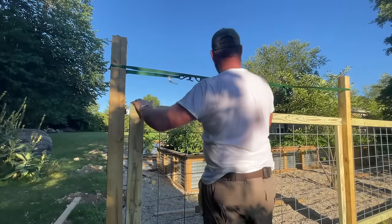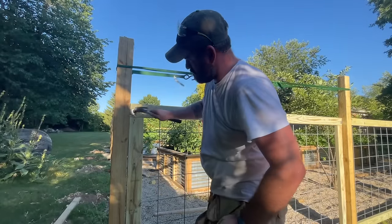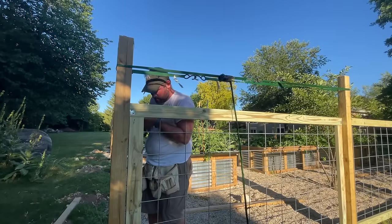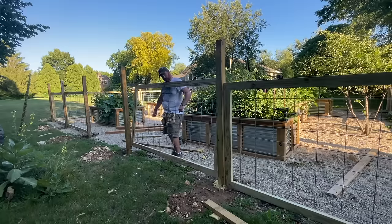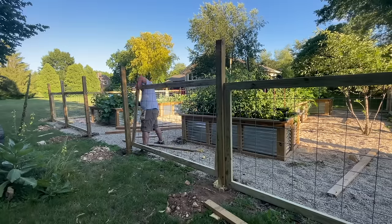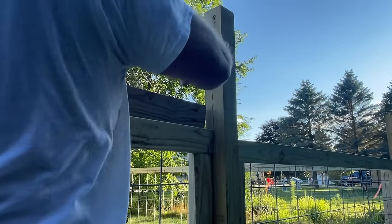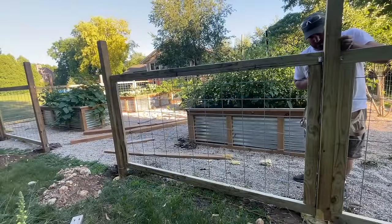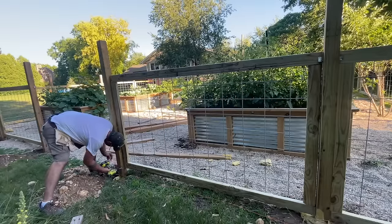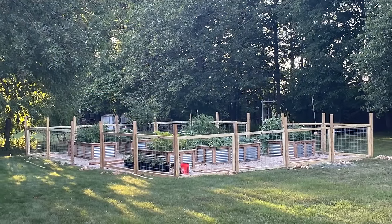One of the biggest pieces of advice I can give reflecting on this project: take your time and budget for errors. For us, digging those holes took easily 15 to 20 hours of the 45 hours we spent on the project. Even though I used expanding foam for the posts, I found they're pretty wobbly, so I'd recommend concrete instead for a much firmer hold on those four by fours. Also, maybe don't buy all your supplies right away because you never know what problems you'll encounter after the posts go in — and build your fence panels in a craftsman style: measure between the posts and build the panel to fit, since some sections may be slightly larger and require ten-foot two by fours. If you have any questions or comments, please leave them below — I'll leave a list of supplies and equipment in the description, and thanks for watching.